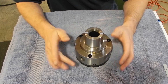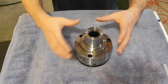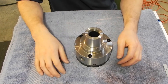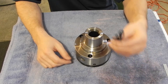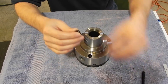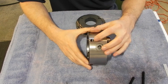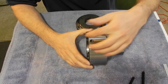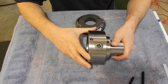I thought I'd do a little review on this chuck and show you the little mods I'm going to do to it, because there are a couple I need to do. So if you haven't ever seen a 5C Collet Chuck, especially a set-true one, let me go through this with you. There are three counter-bores here and these are for the bolts — they just slide down in to hold the actual chuck itself fast to the back plate.